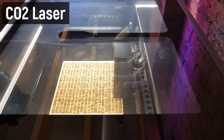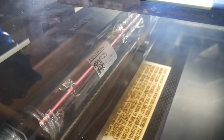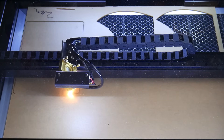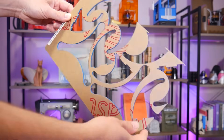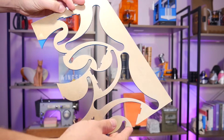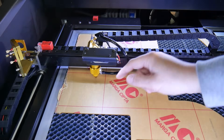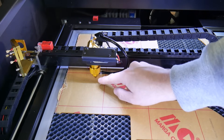Much of my experience has been with CO2 lasers, which use a huge glass — or if you're lucky, metal — laser tube to generate infrared light at a wavelength of 10,640 nanometers, which is readily absorbed by a wide variety of materials. It's also invisible to the naked eye, and because the tube is so huge, the only way of directing that laser to the cutting surface is with a series of reflective mirrors and focusing lenses. Traditionally, all of the hobby laser cutters used CO2 laser tubes, and they almost universally came with some sort of enclosure that would absorb any stray laser radiation in the case of a mirror misalignment, or if you tried cutting a super reflective material.